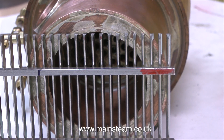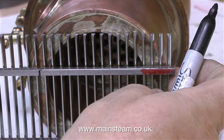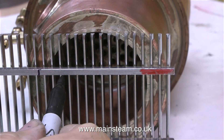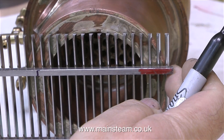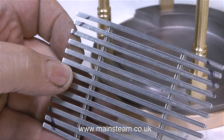The reason that I cut the piece of plywood slightly smaller is that any part of the grate that fits inside the firebox must not touch the side of the firebox. This is very important — you do need to leave a bit of clearance. Owing to the position of the support rails on this piece of grating, it was impossible to make it fit inside the inner firebox, so I decided to go with plan B.